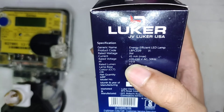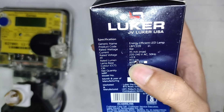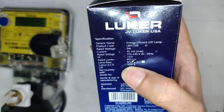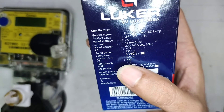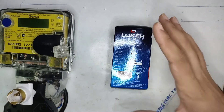Power factor greater than 0.9, which is really good, and rated lumens 855 — I cannot test that as I don't have a lux meter. Lamp base is bayonet B22, color temperature 3000 Kelvin, which is correct because it's a warm white LED bulb, and color rendering index greater than 90 — I cannot check that one either.